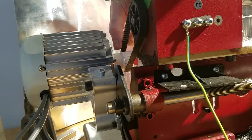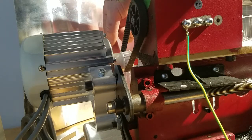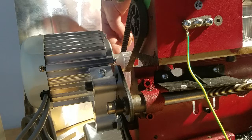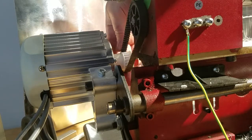I had to make a couple of adjustments to the pulley because there's no keyway, so I made a pulley on Thingiverse — which I'll post down in the link — and imported it into Fusion 360 and then put a five millimeter keyway in there. It fits great.